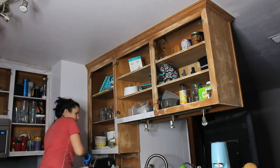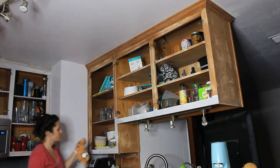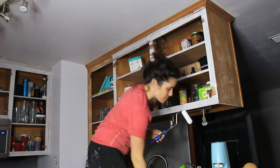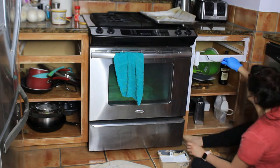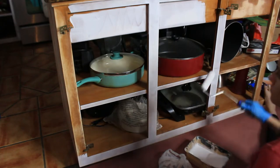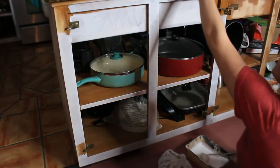When painting the frame of your kitchen cabinets, it's best to work from top to bottom so you don't ruin any paint on your lower cabinets. I used a combination of a foam roller and a small brush to get into any details on my kitchen cabinet. Since I left the hinges on the cabinet frames, I just made sure not to get paint on them — and if I did, I cleaned it off with a damp cloth before it dried. I applied two coats of primer to the whole entire frame.